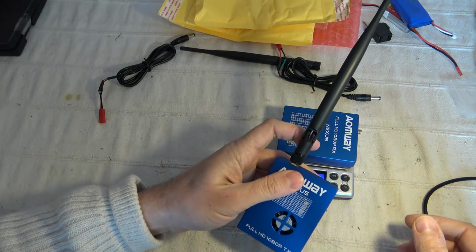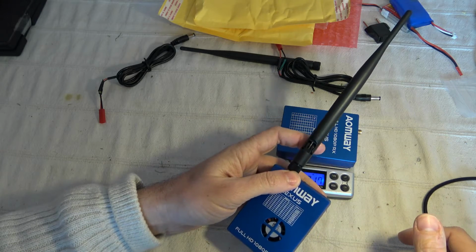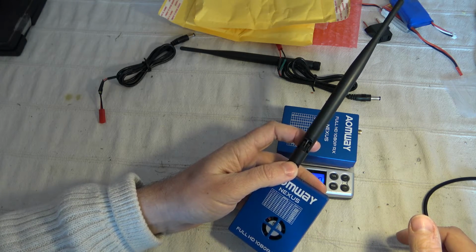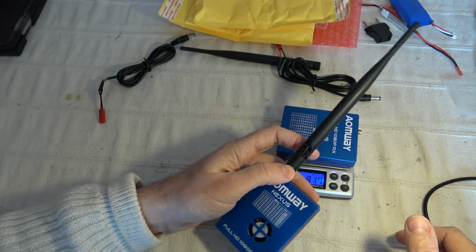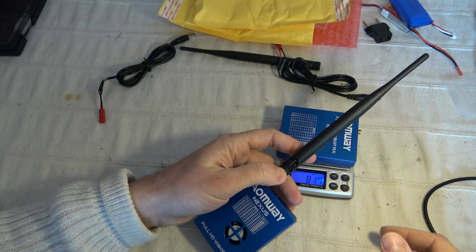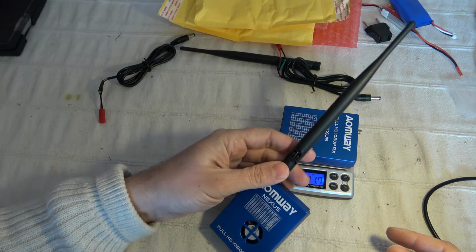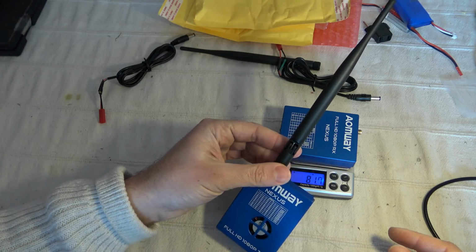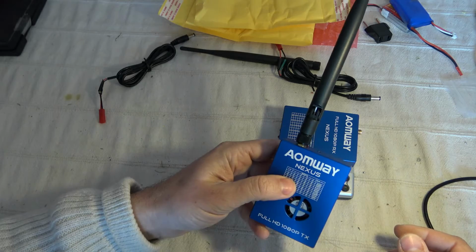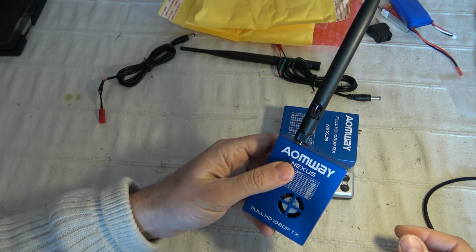If the antenna length is not the right one, and it's clear that it will be much shorter, 5.8 GHz compared to 500 MHz, it should be 10 times longer. We should have something around 10 centimeters, and it's not the case, but it's causing a big problem. If the impedance is matching, I think it won't create any problem, but for sure you won't transmit as far